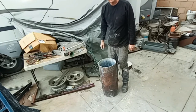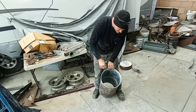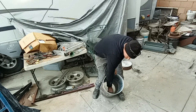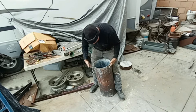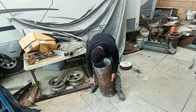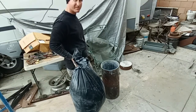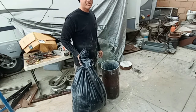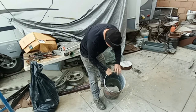There it is — it's finally empty. Got the core out. When I was pressing it through the first time, it was hitting on this seam right here. You can see it's two parts — this one is recessed in and then met up to that one and then it's welded, so you've got this big old lip on the inside. Here's the remainder of the core — about 30 to 40 pounds somewhere around there. This is a 3/16ths wall — very decent sized steel.